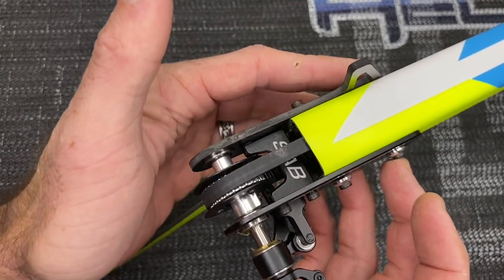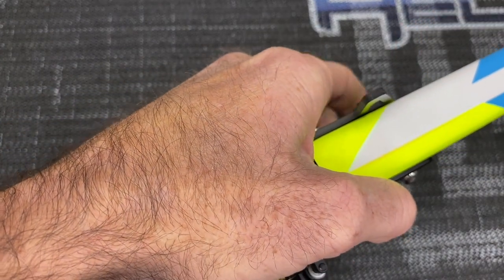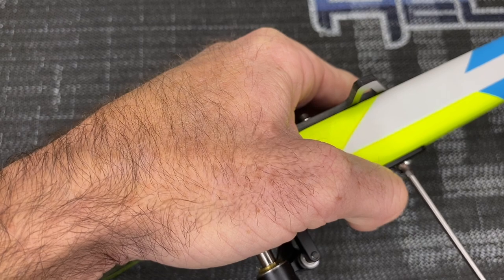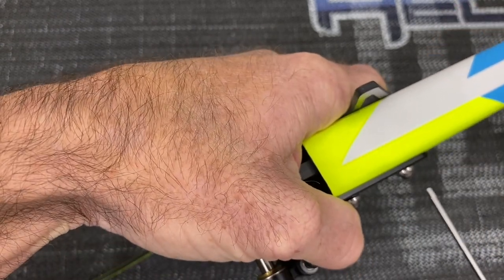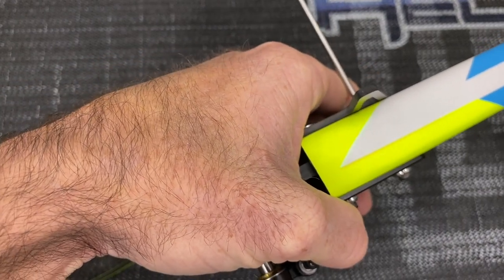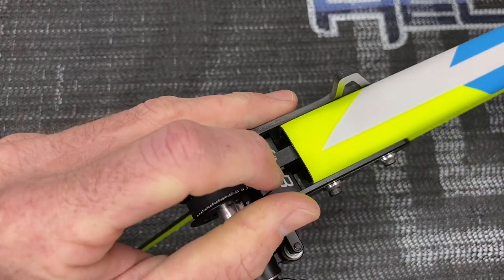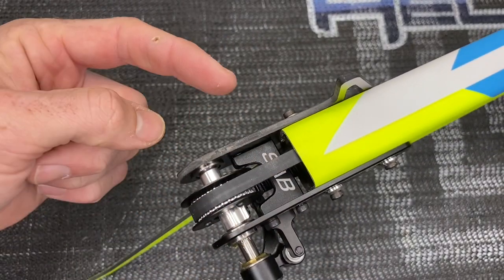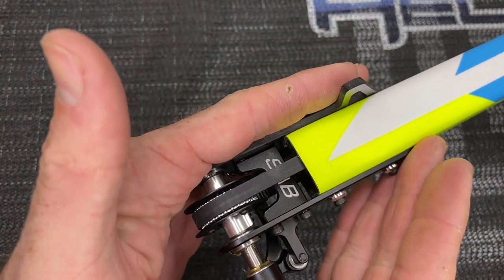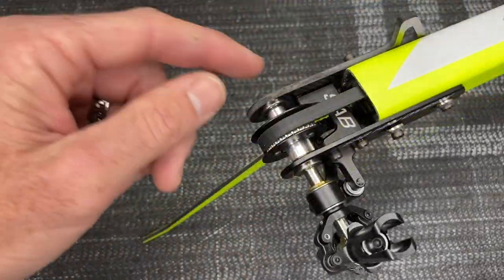With the right side tight and the left side loose, grab the boom with one hand, rock this assembly back, hold it, and tighten. Then come over to the left screw, loosen it, rock it to the left, and tighten. Go back and forth like this until you get the belt tension you want. Once you're happy with the tension, lock the two back screws, but make sure the tail is straight — you don't want it cocked left or right. Work it back and forth until you're happy.